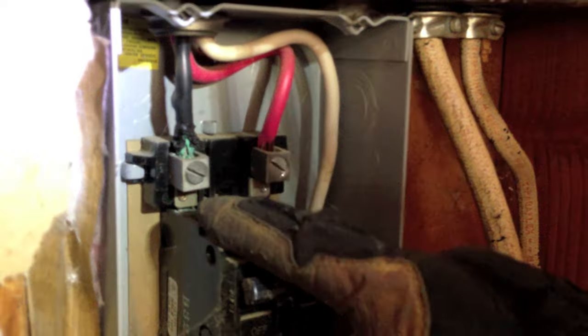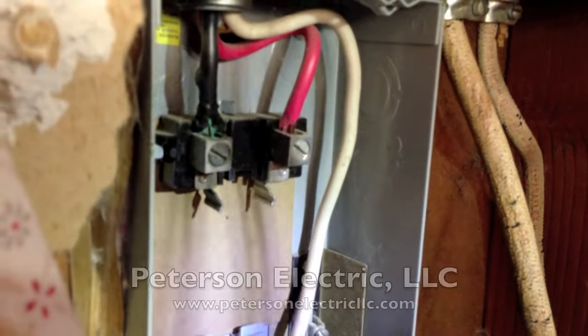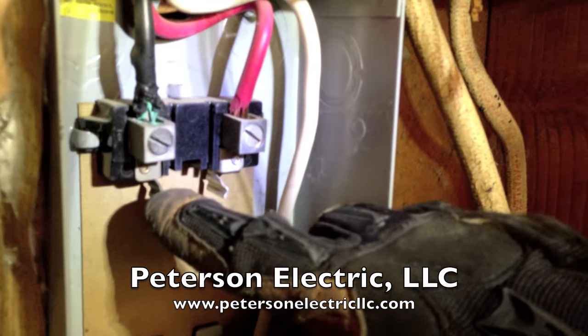You can see this right here — that's a huge example of how this wire has turned green, kind of like your car battery, and started to melt. This shows an out-of-balance phase, as well as the breakers starting to fail inside here and this overheating.